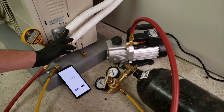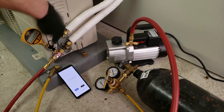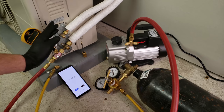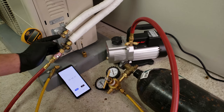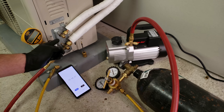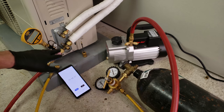You want to make sure you don't have any water or water vapor in these tubes, because that will mix with the oil and end up creating alcohol and acids. Refrigerant and oil circulate through the whole system all the time when the system's running, and you have the electrical windings in the compressor exposed to the refrigerant and oil. It's actually to cool the windings down, but if you have acidic oil in your system it's going to break the compressor electrical windings down and you could have a compressor burnout. So it's very important to prepare these lines.